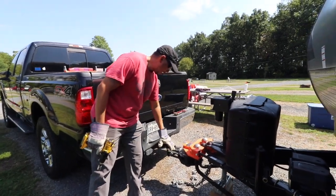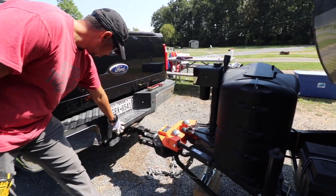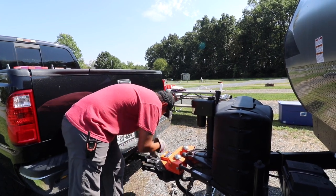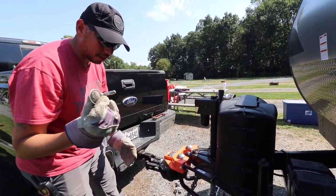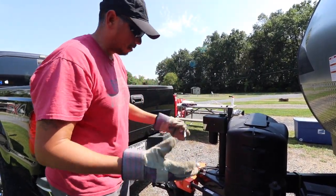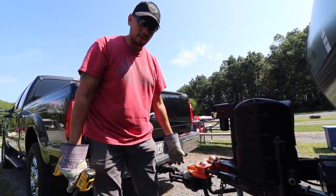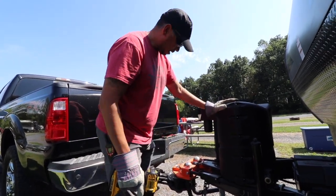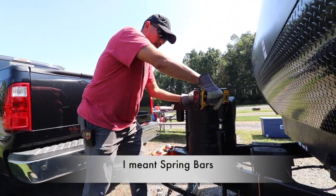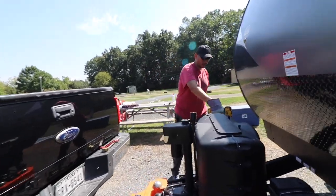The first thing — after you make sure you've disconnected everything, all the harnesses and chains from the trailer and the truck, so nothing is hooked up — is to remove these little guys. Sorry if I don't use all the right nomenclature. I'd also recommend wearing gloves because you can pinch yourself. First thing: the stabilizers are still tight, so you want to loosen them up. The instructions say loosen them till they're 'sloppy loose.'